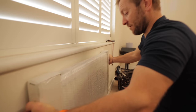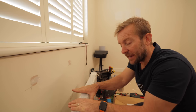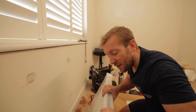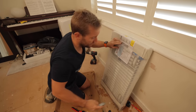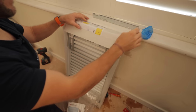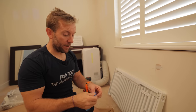I can already work out the height of the radiator. Using the mark on the wall and the bracket measurement, I need to know exactly where the brackets will go, because they're lower than the top of the radiator. Grab your grommets — they change the height slightly. The further off the wall the radiator sits, the more opportunity there is for it to heat the air at the back and give out a few more BTUs.